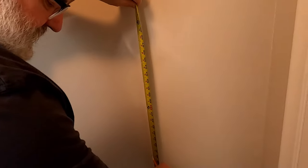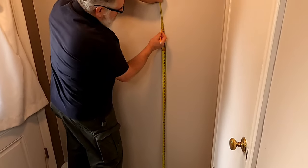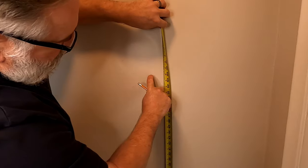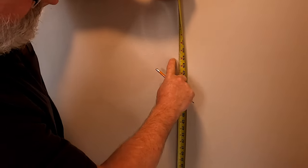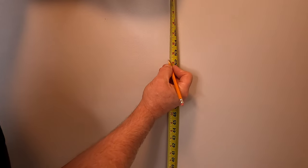I'm going to get started. My coat rack is 27 inches wide, and we want to install it about four foot six inches to the top of it, so the kids can hang their coats on it. So I'm going to measure four foot six, and I need to come down an inch and three quarters, because the coat rack itself is three and a half inches wide, so I need to come down an inch and three quarters and make my mark.